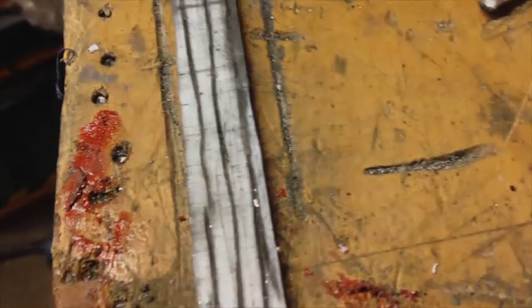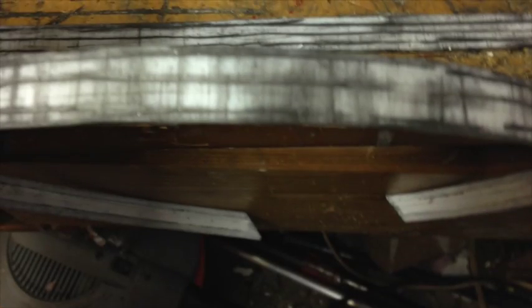The short marks or wear areas are from either material in the cylinder or roughness to the wall. You can see a good bit of wear here. One of the things we're concerned about is with these PTFE rings and their wear characteristics.